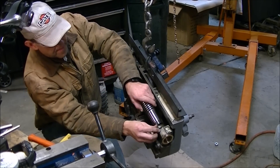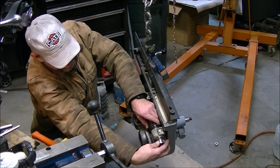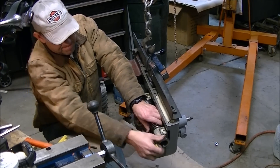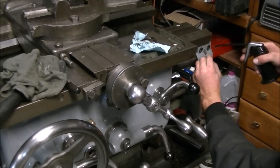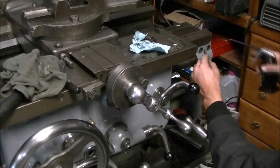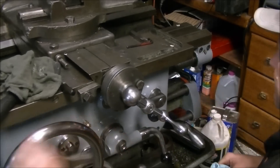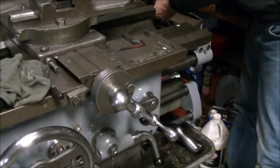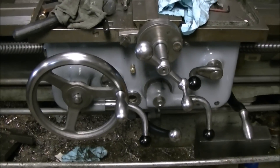The worm that drives the longitudinal feed goes on — that's the housing that's been repaired. You can see the bronze bushing there, for the repair on that chewed-up surface on the worm and in the end of the housing. Getting the apron back on, I had to put the brackets on that hold the ends of the lead screw, and below it is the shaft that engages the lead screw reversing forward and reverse lever. Getting it all back together and making sure everything works — a polished and painted apron.